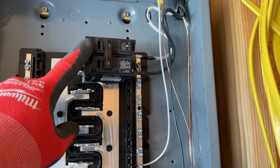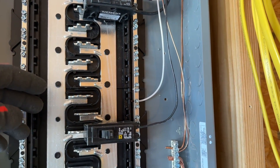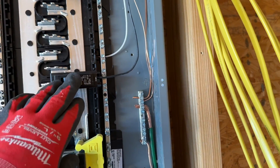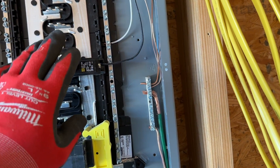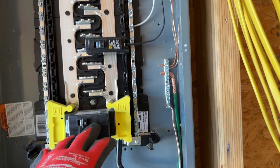We have a 40-amp up here that already feeds our AC unit. We have 30s for some of the bigger appliances like the washer, dryer, microwaves, or stoves. But really easy — you can do it yourself. You can add a circuit to an existing panel. Make sure everything's off before you work on it, and it's just this simple. That's pretty much it on how to wire in a breaker. I know there are unique situations, but I just wanted to show you that it's not that complex behind the panel — it is something you can do yourself in new construction or even to just add another circuit.